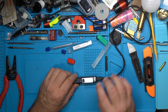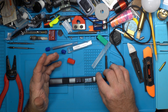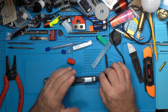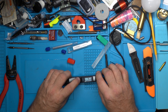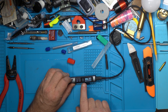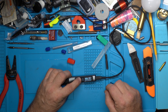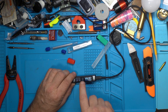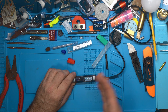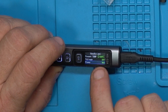This setting is not sticky, which is why they've made it just a temporary deal. My recommendation for the HS02A would be to hold down the middle button — the right arrow button closest to okay — hold it down as you plug your cord in, hold it there until you see the warning words about the tip being hot, then click okay and it'll preheat.